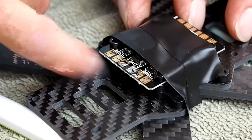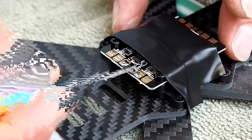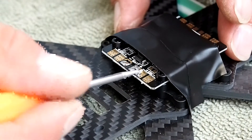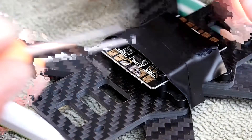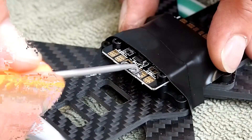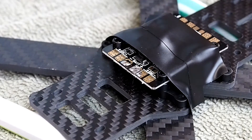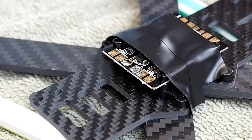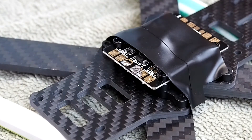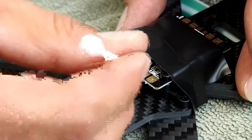We put too much on the positive pad. See that? I'm not covering the whole pad, but there's plenty and it's nice and shiny. There is some solder I did get on that ESC positive pad, but that's okay — it's not bridging. We're not going to have enough space in there. I may even take a little pick tool and just make sure there's no little solder ball or loose solder in there. Make sure we got separation. Now that there's solder on both pads, I'm going to clean those. Fresh Q-tip, a little bit of alcohol. I'm going to clean the solder because there's flux on there.